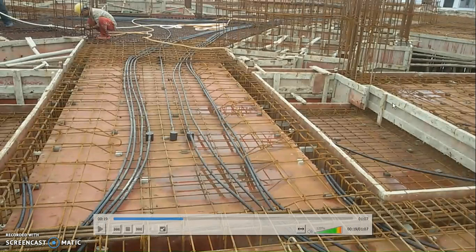Here you are able to see this is the duct. This is the toilet portion, which is called the sunk portion. This is the reinforcement of the sunk slab in the toilet. You can see a beam side fixed here. This type of shuttering is called sunk shuttering, done in the sunk portion. This is called hanging type of shuttering.